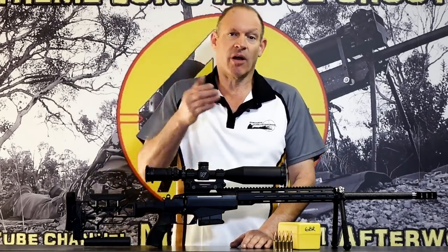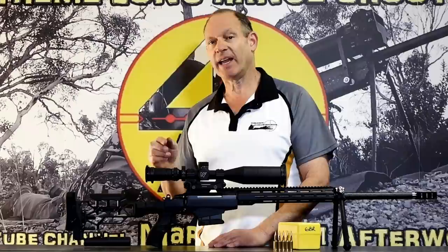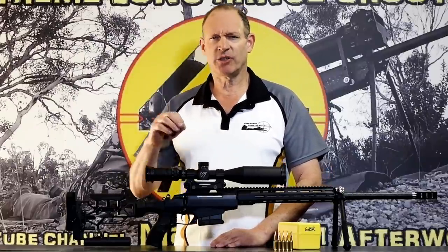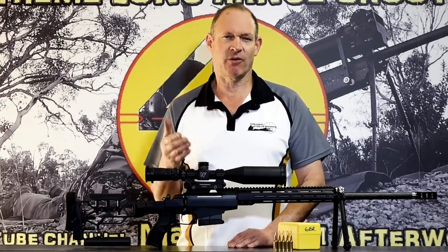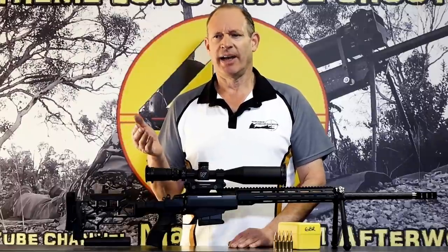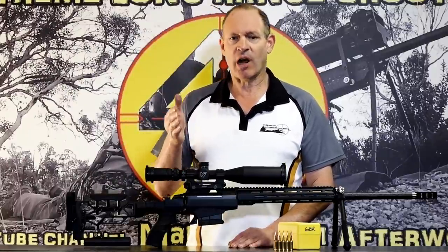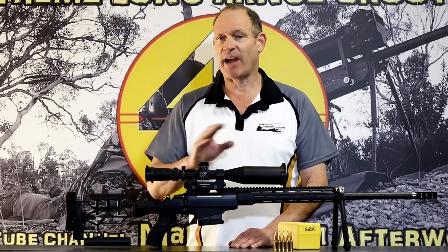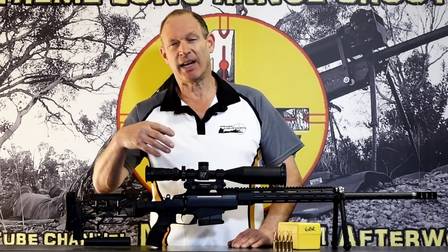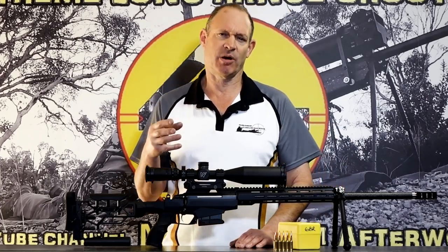In general, the nutshell of this conversation would be, if you're blowing a primer, although it can be too much pressure, there's almost certainly going to be other signs before a primer lets go. There's almost certainly lots else going on before a primer goes. If a different primer fixes it, then okay, that can fix it. If that works for you, fine. But most commonly, it means there's actually another mechanical issue in the rifle that's causing the problem, and a tougher primer is fixing the problem.